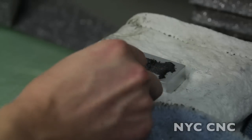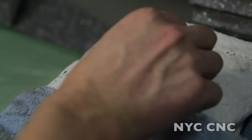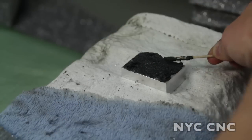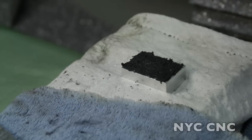You're just going to use a toothpick and apply some of this stuff onto the surface of the part. I like working with this 90 grit because you want it a little bit thinner — you can always mix it down with something like motor oil. Whereas if you've got thinner stuff, 120 grit or 220 grit, you can't really make it thicker. I also like this particular type from McMaster because it doesn't tend to fly all over the place.